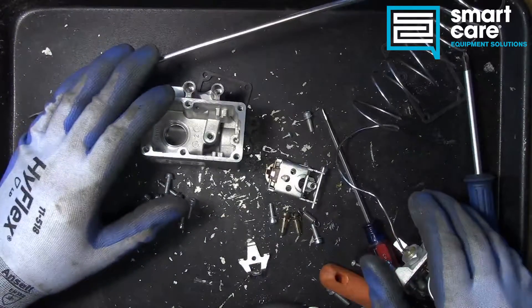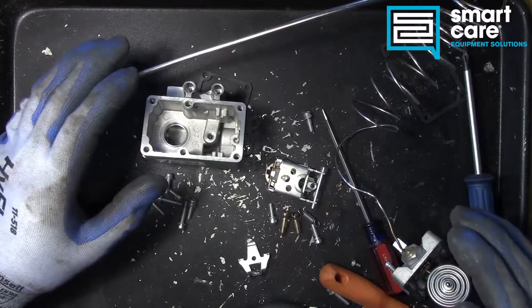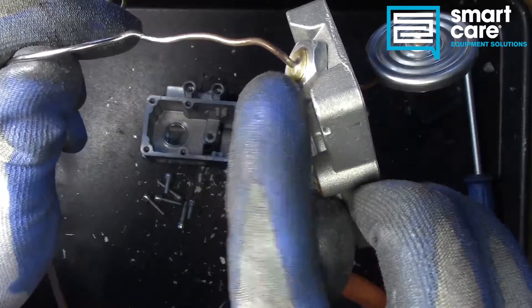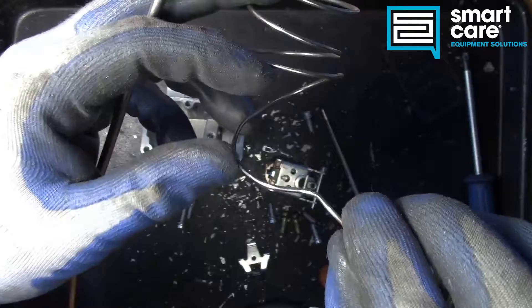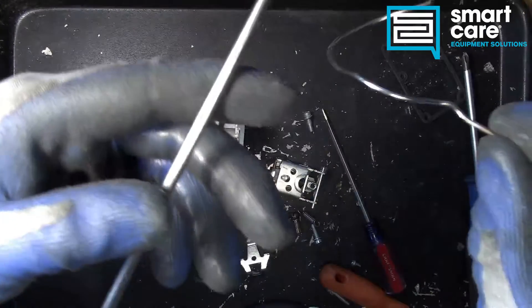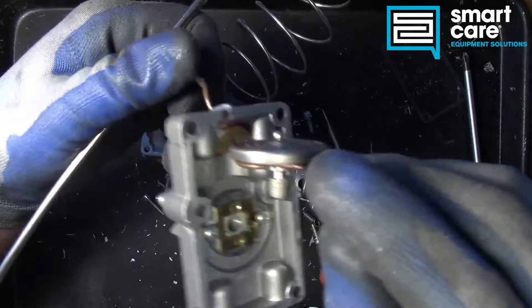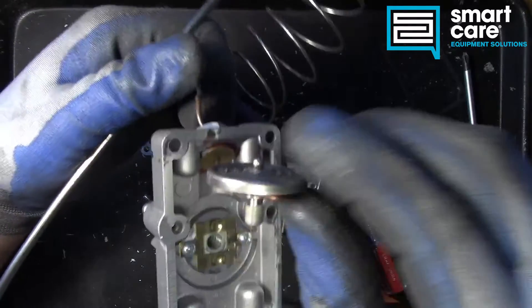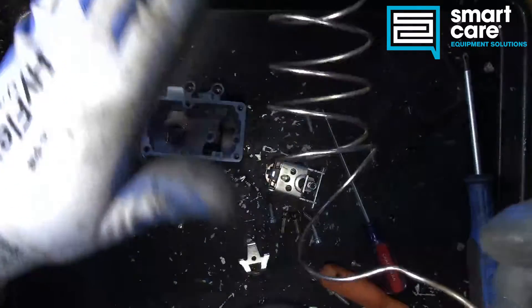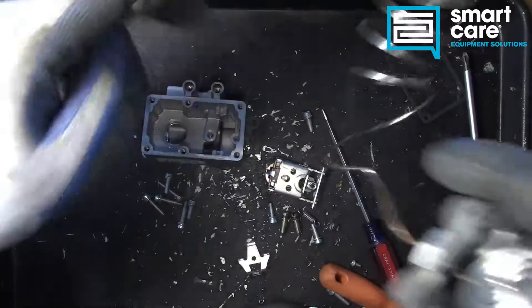When we talk about how this fails, the failures are almost always in the capillary tube and bulb. Anything that happens to damage this — in particular back where the joints are soldered, or if it's flexed too many times and breaks off or becomes damaged — it loses its charge, or it can no longer move the pressure through the capillary tube, and that makes the bellows ineffective. The bellows itself doesn't usually wear out; it's almost always an external failure from being flexed, heat-cycled, or physically caught and damaged.